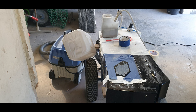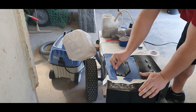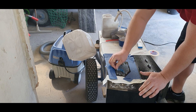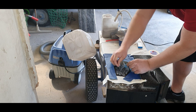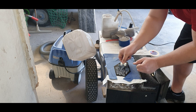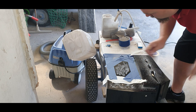I also want to protect the engraving from rain. If you compare sandblasting to laser engraving — laser engraved stone on a rainy day you wouldn't see the engraving. The benefit with sandblasting is you can color infill it easily and you'll see the etching even if it rains. Also, you can recolor the image several times — if the color fades after one and a half or two years you can color it again, so that's not a big deal.